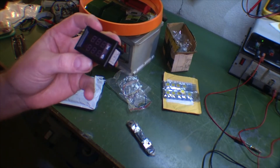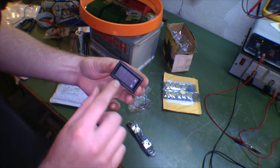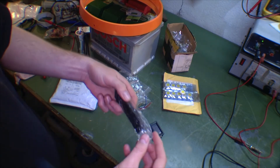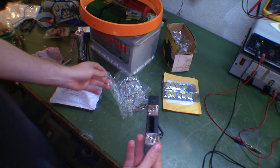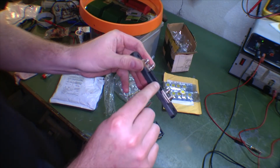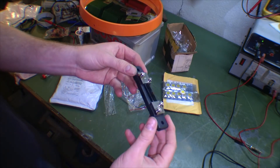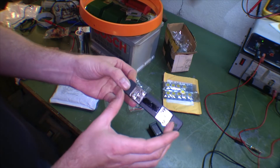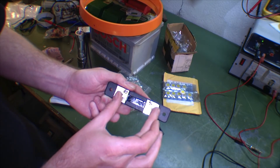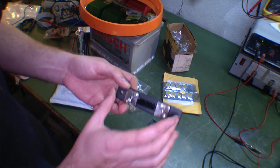That's important because I want to use it on my battery bank, which is 48 volts, so I need the high voltage range and I need to read how many amps I'm drawing. It comes with a shunt — what this does is you send the amperage you're using through this piece of metal right here in the middle. That piece of metal, when there is a high amperage coming through it, will resist it — it acts like a resistor. When it's a resistor there is a voltage between these two spots, and this little meter measures that and tells us how much amperage is coming through.